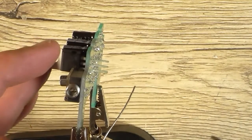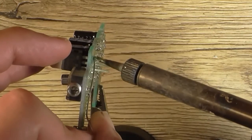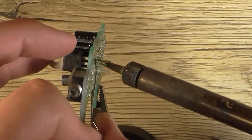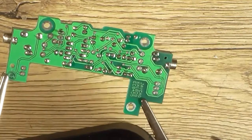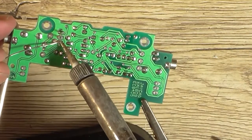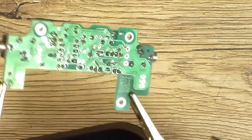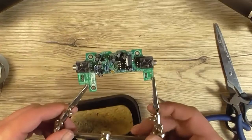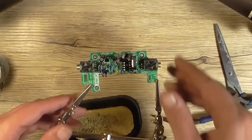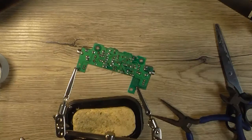So what I'll do is I'll hold it while messing around with the soldering iron. Right, just to get one tacked in and then finish it off. And as it's only drawing 7 to 8 mA, it shouldn't require a heatsink either. Now, that's the MOSFET in, and it's as close to the board as it can get. I'm missing another 100N, that's where that goes. Okay. I love building kits, I must admit.